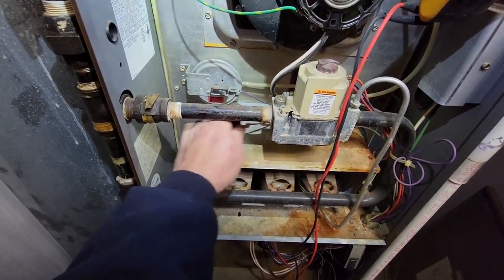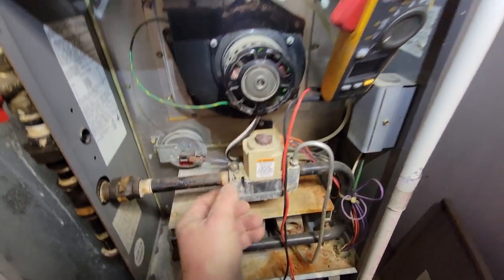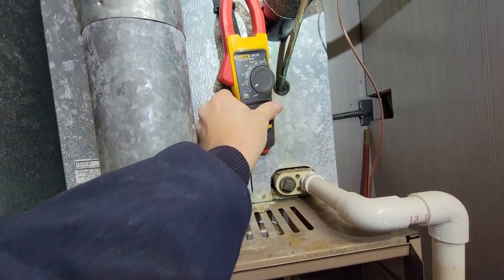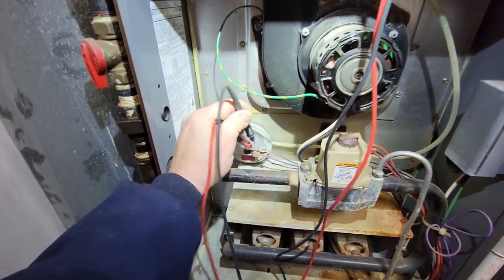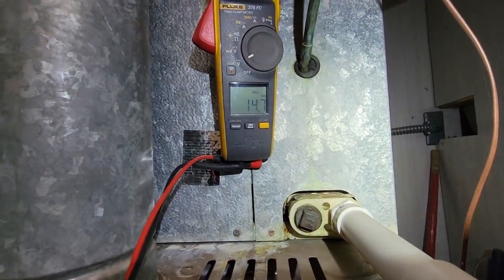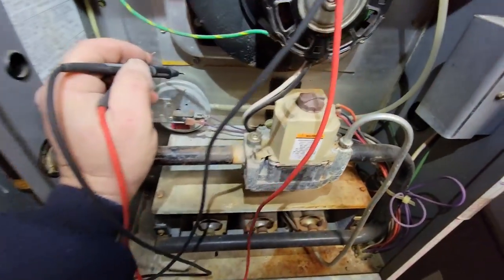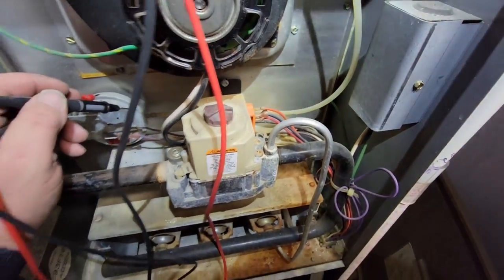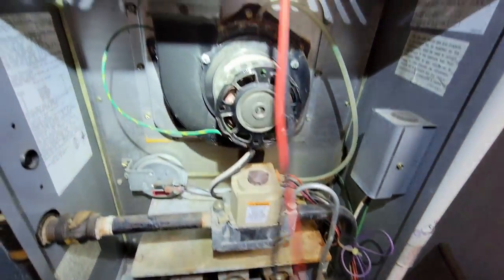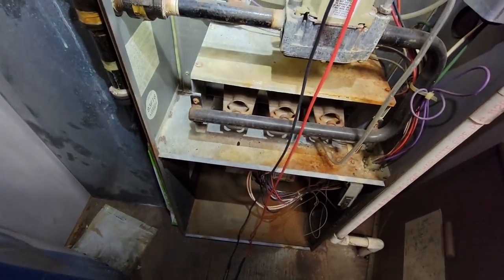What I'm getting at here is you don't always have to use your meter. One of the guys that taught me in the beginning days showed me how you could get away with using a jumper cable for pretty much everything if you didn't have your meter. We are at 14 volts AC there, so it's technically open. Limit switches — if they were tripped, they'd be running a blower. This thing is in really poor condition.